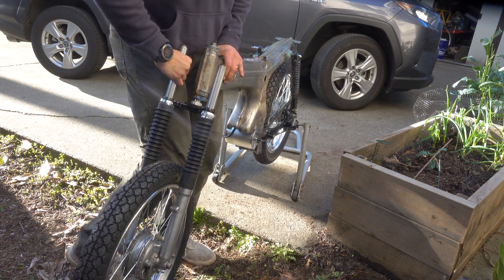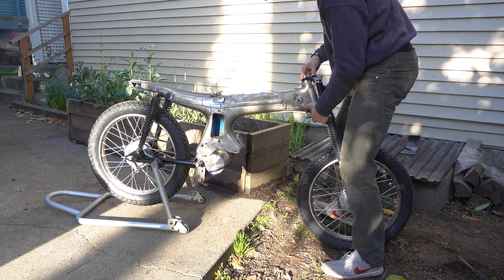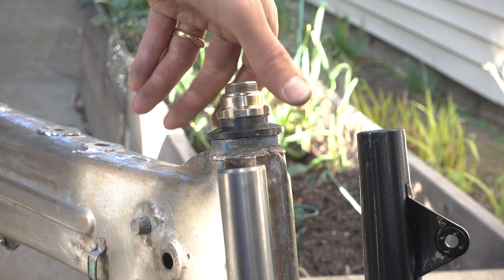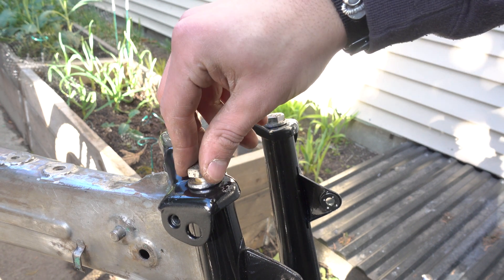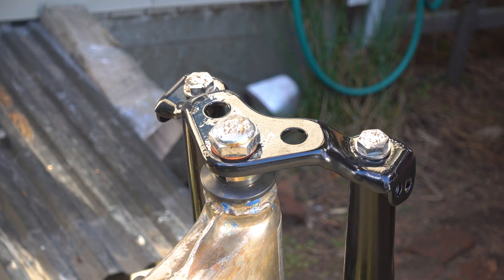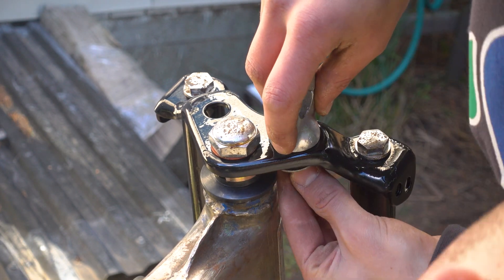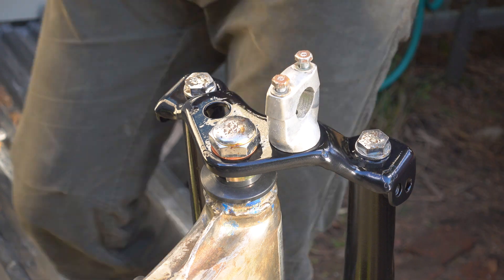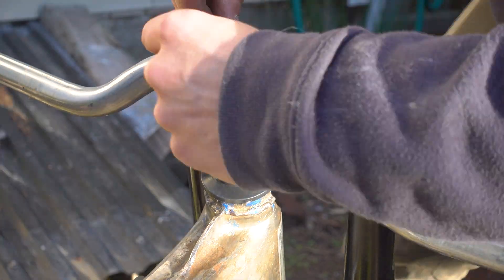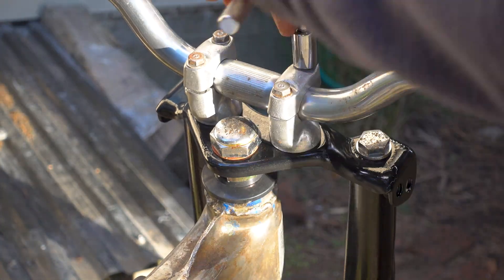Being able to ride this bike for the first time was a lot of fun. However, it was very slow — much slower than I thought it would be. Makes me really question if I want to stick with 2,000 watts for this motor. The ratings of the bike are: 48-volt battery with a 19.2 amp-hour discharge, a controller with a rated current of 33 amps which is the most limiting factor, and the motor is 2,000 watts at 48 volts. I am considering upping it to 72 volts, 3,000 watts, with the battery to match. We'll see if that gets updated in the next video.